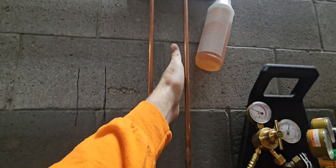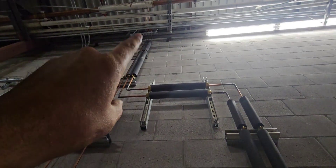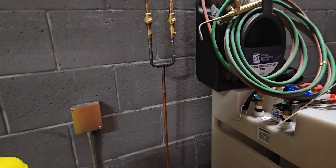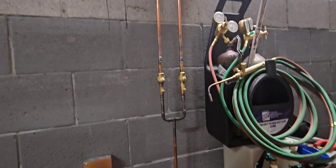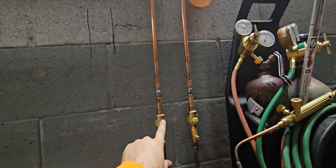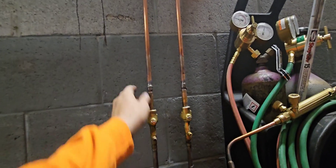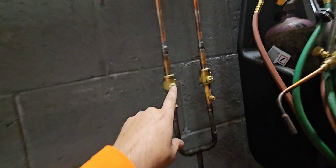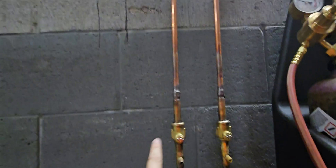Once those two things are closed, it'll energize our pump contactor, which will energize our pump. Essentially what's happening is you have one line for one rack and one line for the other rack, with these ball valves for isolation. When the pressure gets too low, that pump turns on and pumps up. These lines go to the return lines on the glycol lines out on the sales floor. When that pressure gets too low it should automatically start filling. I don't think it knows which one to fill though — I think you have to keep these off and then turn on the one that's low. So if rack D is low on glycol, I'd turn this on, it would sense the low pressure and pump it up. Otherwise this would just be an equalization line between both racks.